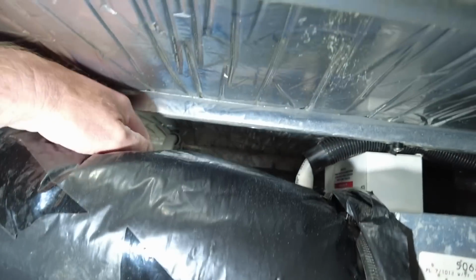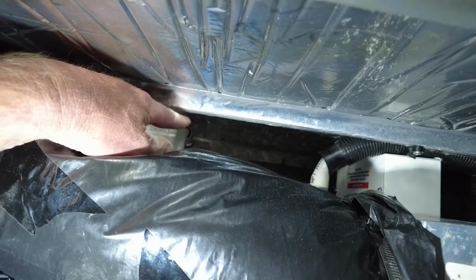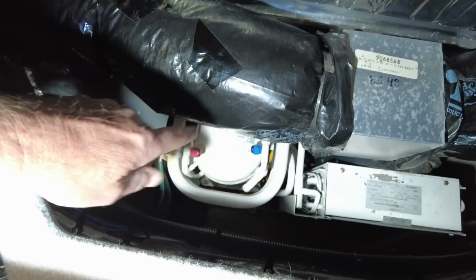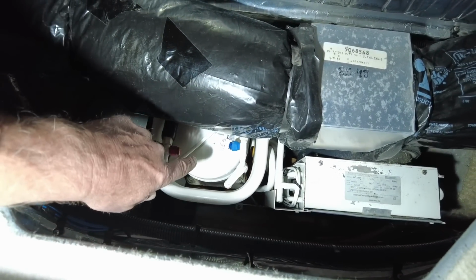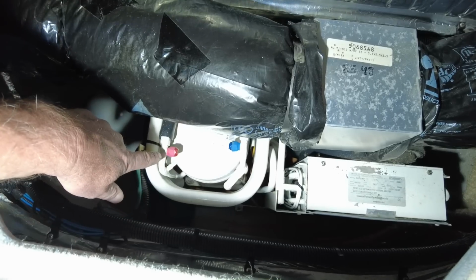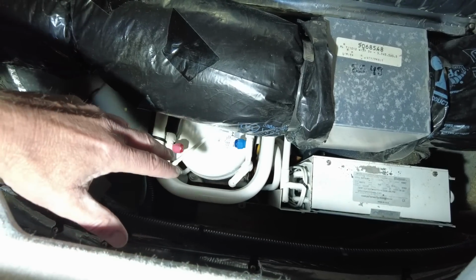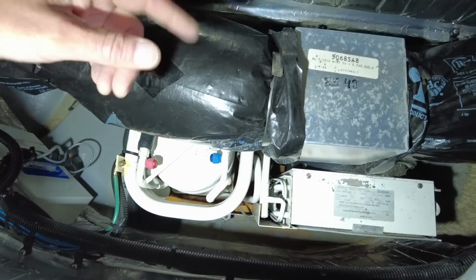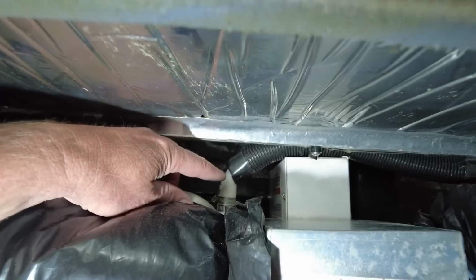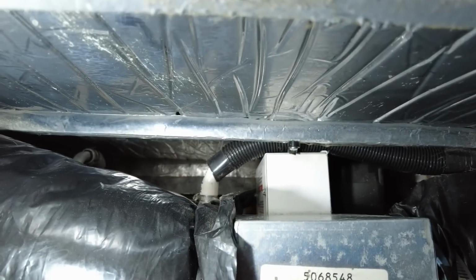So as you can see, this is the water line coming in. This is the one that's grabbing the seawater and being pumped through from that pump. And it goes through this coil. The compressor's inside there, with the refrigerant, and it does its thing. I'm not a refrigeration guy. And it makes the heat or the cool. In this case, it is the heat. And then on this side is the discharge line, and that's where we saw the water coming out the side of the boat.